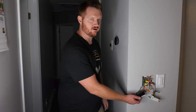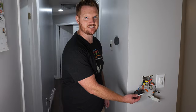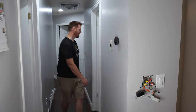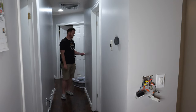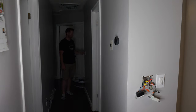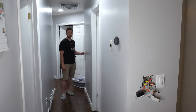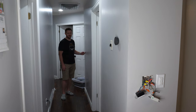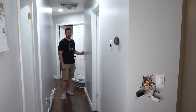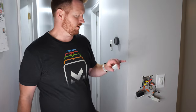Here we have the hot coming into the common and our two traveler wires. All we're going to do is take off the switch, then take the hot and the two traveler wires and wire-nut those together. Pop those in and we can add our wall plate bracket and Pico remote right here. Power's back on — let's turn on the light. Turns on like that. Here we can dim the light, and then we come down to our Pico remote and turn it off. Turn it on, do the dim level, and we even have a favorite level we can choose with the Pico remote. That is how you can use a three-way with the Pico and the Diva dimmer switch.